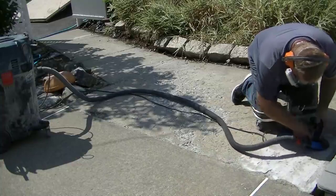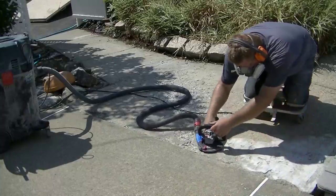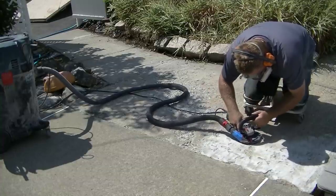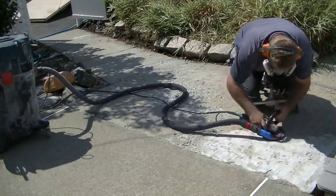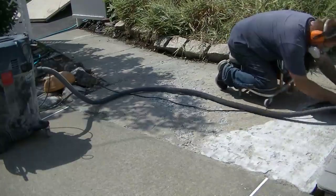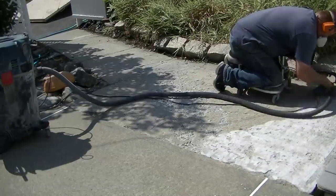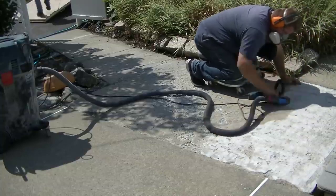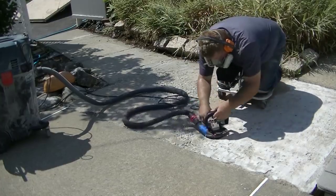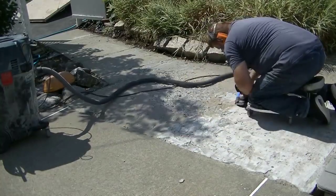The first thing we're going to do is remove all the bad concrete on the surface, and one of the ways we do that is by lightly grinding it. I've got my Bosch 4-inch grinder with a diamond disc on it, hooked up to my HEPA vacuum so we don't worry too much about the dust. Luke is just going over the surface removing any of the loose concrete, and when he gets into the worst, more spalled areas, that grinder will really remove the loose concrete down to solid material.